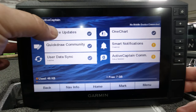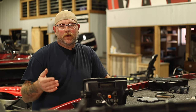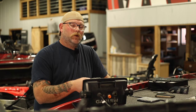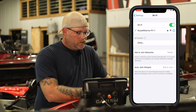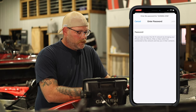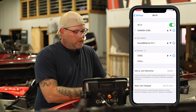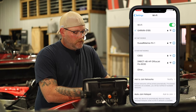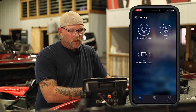It's going to take you to your software update screen. It says no owners set right now — no problem. Now that our Wi-Fi is set up and has a password on the unit itself, I'm going to move over to my phone and connect to this unit's Wi-Fi. Remember, Garmin 5195. So go into my settings here — there's my network, our super complicated password — and join. Once I show that I'm connected to the unit's network, I'm going to go into my ActiveCaptain app.